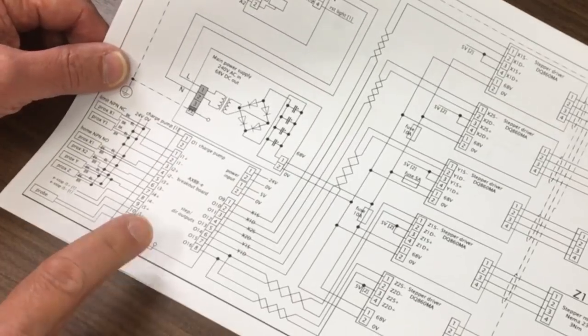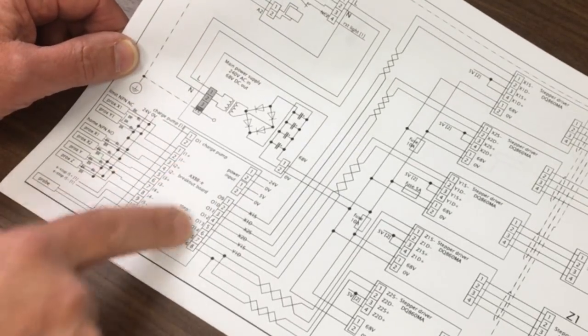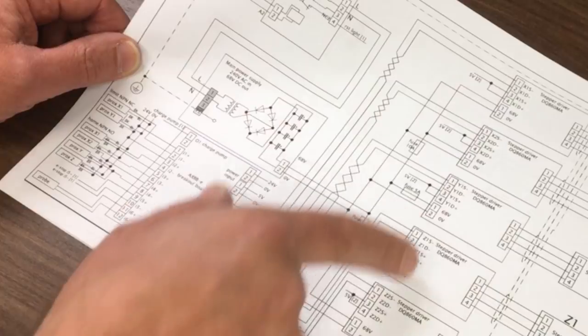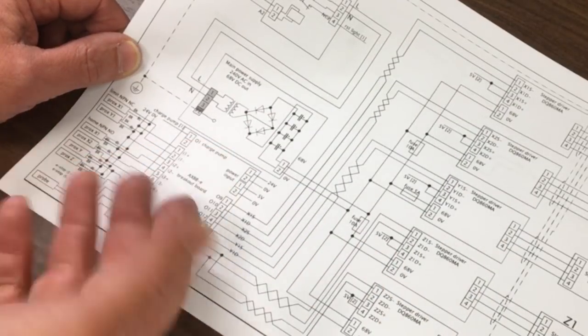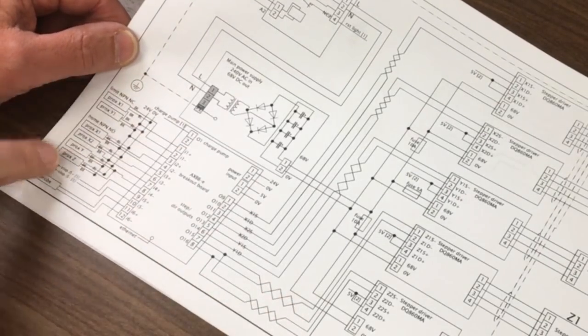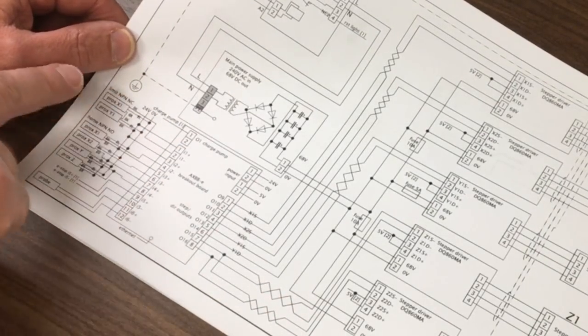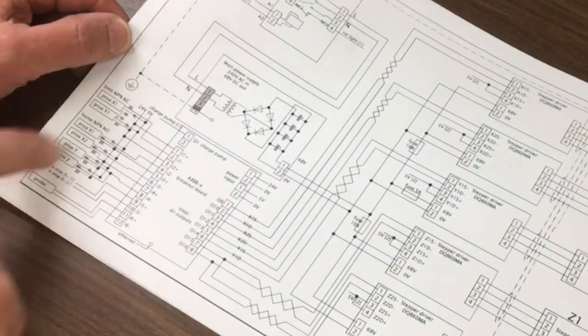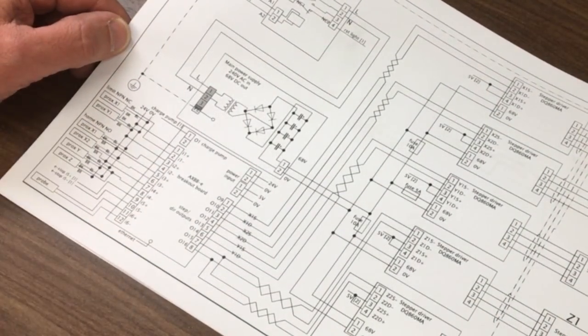And then down the bottom here you've got the breakout board itself. You've got the step and directions down here, which go through these twisted pair cables into the drivers. You've got power coming in. Now this unit needs 24 and 5 volts, so we've got those there. And then on this side we've got our proximity switches. I'm using proximity for my limits. You can use micro switches, whatever. And then homes, I've also got proximity.